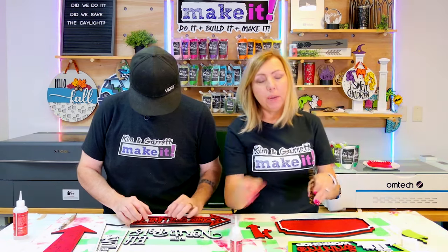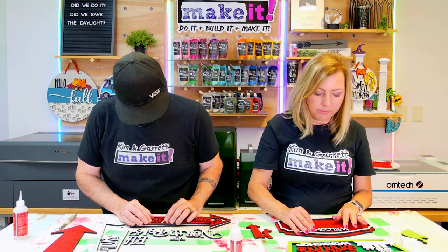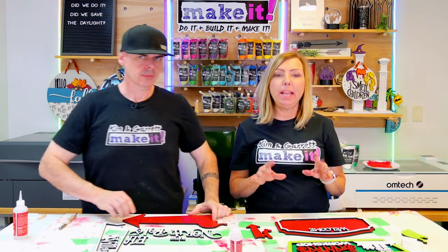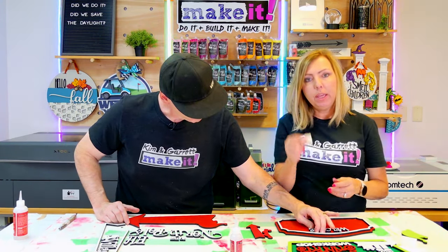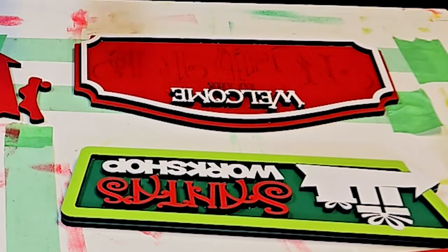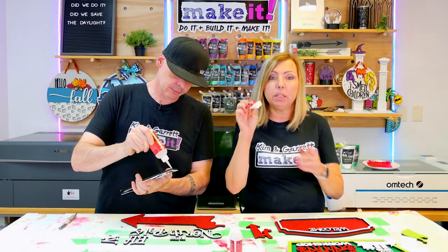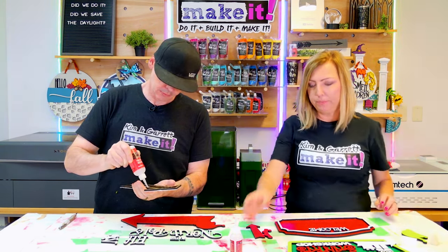A little tip with the Starbond glue. While it is great for gluing MDF to MDF, if you get a little glue outside of your pieces, especially on darker boards, it'll dry with a white hazy look to it. So if you get a little oozing out and you need to pick it back up, use one of these little foam wedge sponges, dab up the excess glue. It's the perfect way to pick up the glue without leaving that residue. If you try and wipe the glue, it'll leave a residue, but the sponge here just soaks up the glue and pulls it right up.